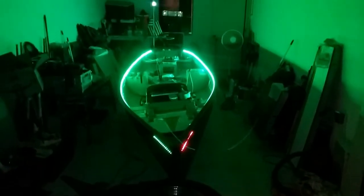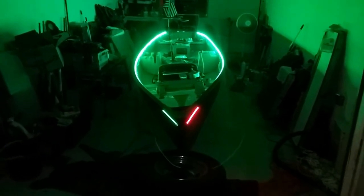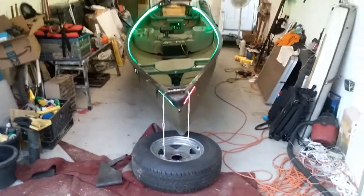Here's the inside LED light so I can fish at nighttime. Going back toward the front — I'll have those hooked on two separate switches. Right now I have everything hooked together. There's the red side front LED navigation light and there's the green side front LED navigation light. You can see both of them. I have everything running on one circuit right now but I'm going to change that — it's just temporary to make sure everything's working. I'm going to hook everything professionally into this control panel, which will light up too — when I flick a switch on, it'll light up green to tell me it's on.